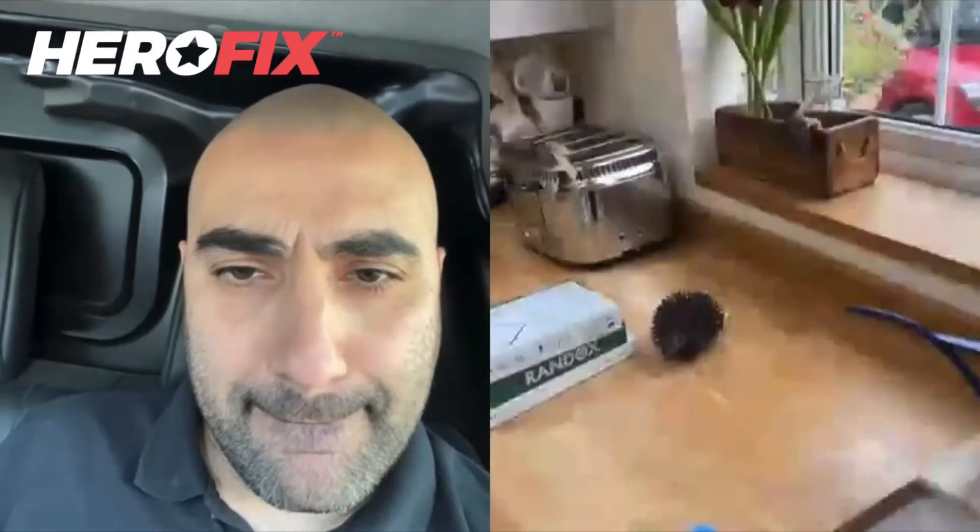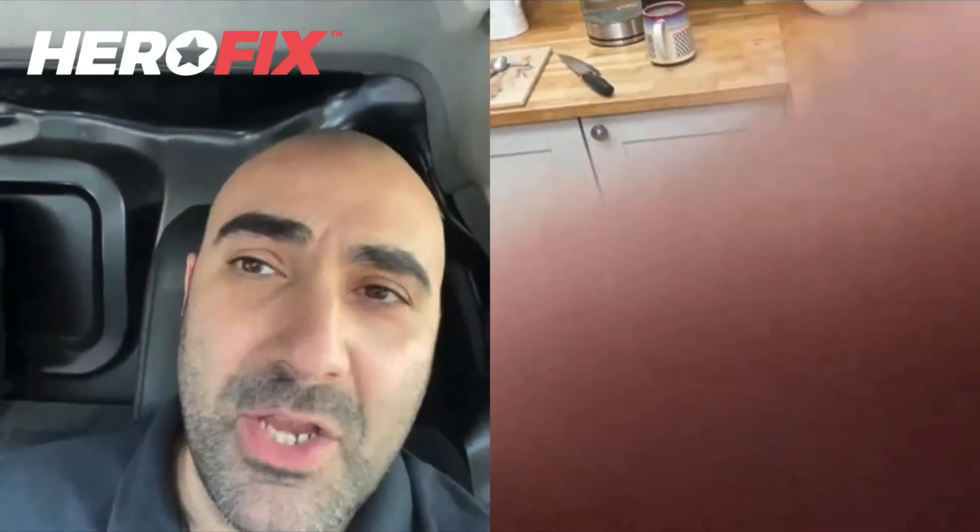Now go to a hot water tap and try and turn the tap on for me. There you go. Very simply, what you've done there, Matt — when you fill the boiler up with an integral filling loop, it will shut the supply going to hot taps. You topped it up, it filled up, but what you hadn't done is put the handle back to allow the flow of water into the boiler.